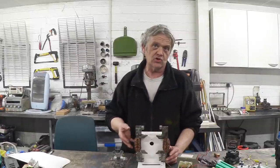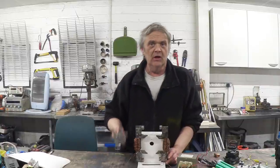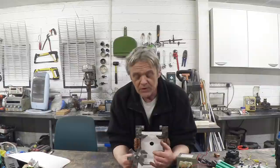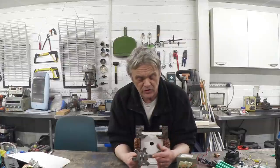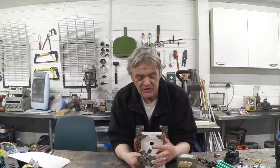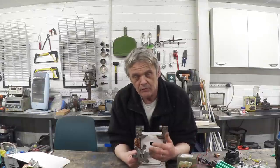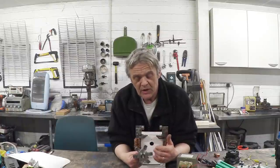Now we went through the actual construction phase previously but didn't really show this arrangement. You'll notice there are four poles on the stator and six poles on the rotor — that's necessary to align and misalign in the generator arrangement. A few people have said can that be turned into a motor? Well the answer is yes, but for a motor we can't have more rotor poles than stator poles. The minimum is four-four. It would work better with two poles on the rotor and four on the stator. If there are the same number or fewer poles on the rotor than the stator it will work as a motor. If there are more poles on the rotor than the stator it works as a generator.